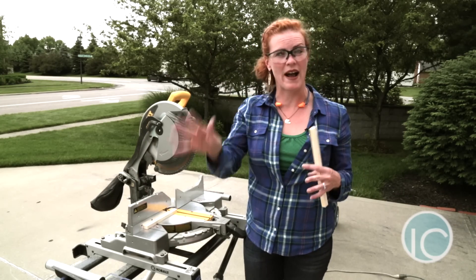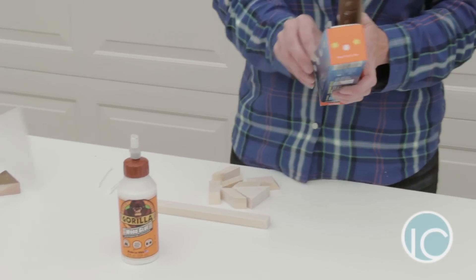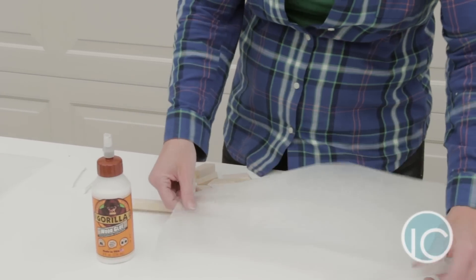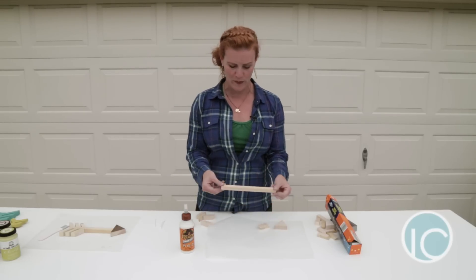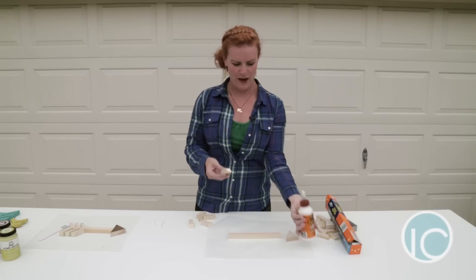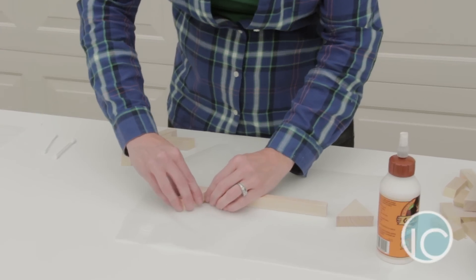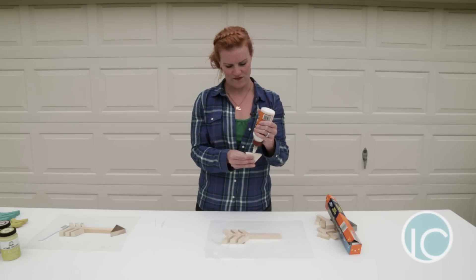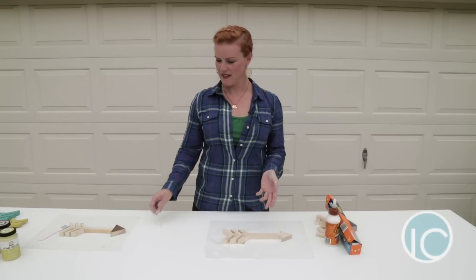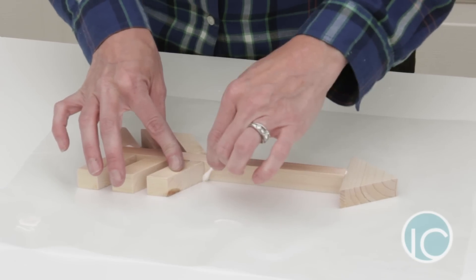So I have all my pieces cut. I'm going to go back over to my work table and show you how to put it together. Here are all my pieces and they're already sanded and ready to go. I like to take a piece of wax paper and put it on my table and then just start gluing. Find the best side of all your pieces. Start with the tail and put a little glue on it — if you get too much, just use your wax paper to dab a little off, then squeeze the pieces together and put the point on. And there is your basic arrow. I usually take a q-tip and just clean off all the glue so it'll dry nicely.